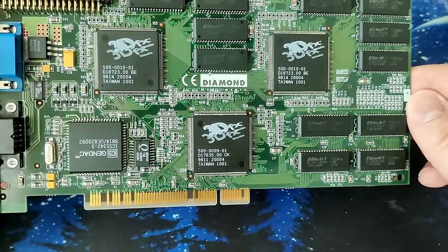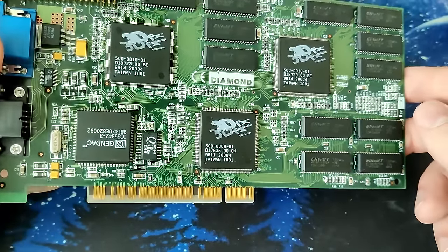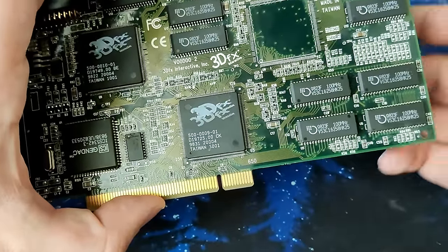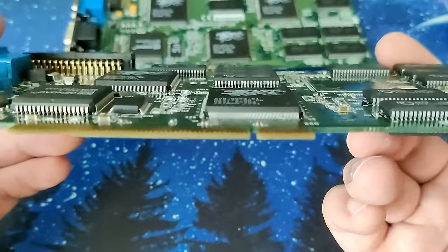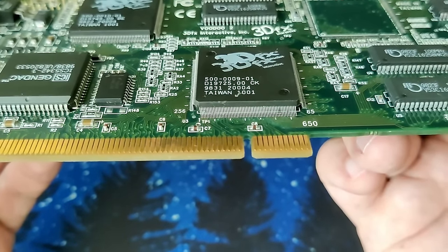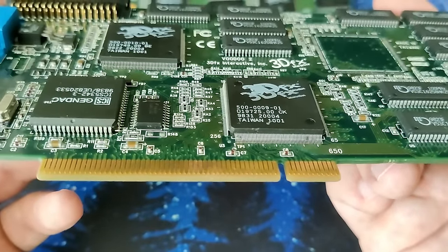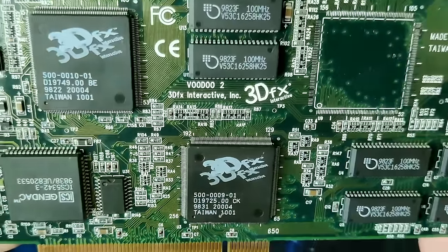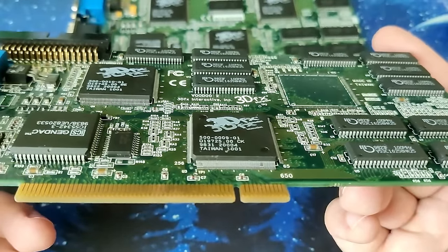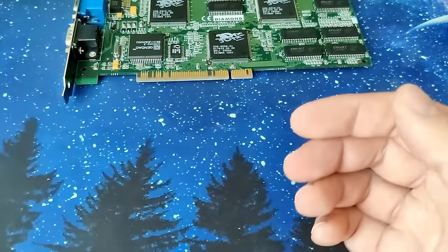And the only other thing I can think of is to take off the 3DFX chip, but I really don't like to do this. I do have a donor board, and it has a frame buffer chip, but I don't know if you can see this very well. It got knocked on one side, and it's completely bent. All the pins shifted to the left. So yeah, this would be one other thing we could try, but this is obviously a lot of work. I'm not sure if I want to do that.